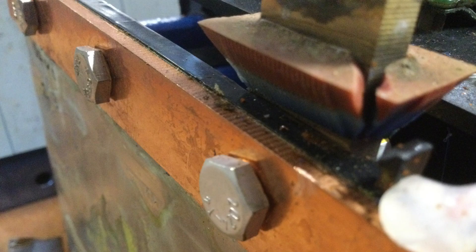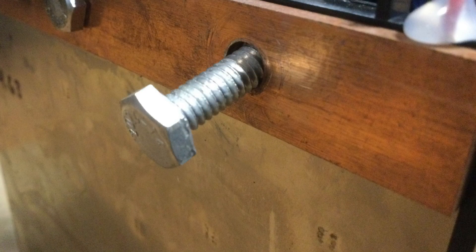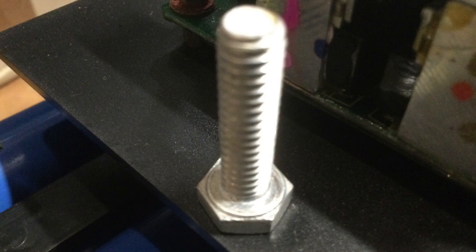I decided to investigate this connection further and discovered that the hole is considerably oversized for this bolt. None of these threads are making a connection — it's really only the head. And to make matters worse, it's not the entire head of the bolt, just this raised flat underneath the head. So this small surface area is being tasked to carry the max continuous load of these batteries. On top of that, the use of aluminum is kind of strange.